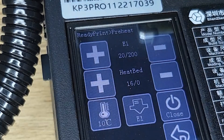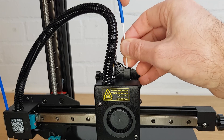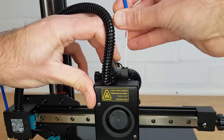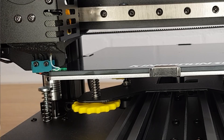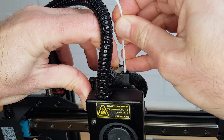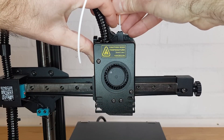I heated my nozzle up to 200 degrees so that I could load some filament. Guiding the filament in was a little tricky as it needed to be straightened before it would pass through, but once I got it threaded in I was able to push it all the way through and out of the nozzle. As with most new 3D printers there was already a little bit of filament in the nozzle from where it had been tested prior to shipping so I purged this out. However very quickly I found that I could no longer move the filament — I couldn't push it in or out, and it became pretty clear that I now had a clogged hotend.